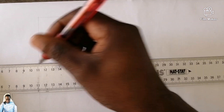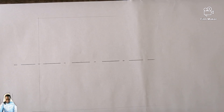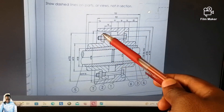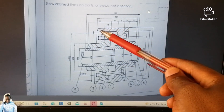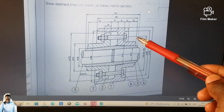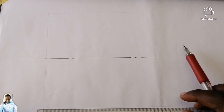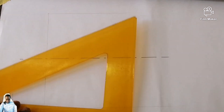From here I can have a center line here, then a faint line like this. Now let's get the dimension from here coming to the side - that dimension is 102 millimeters from here till there. Remember this is not item one, this is item two - it's not part of our drawing. What we are concentrating on is these hatches. The dimension from there till here is 102 millimeters. So from here till there, I can measure that 102 millimeters - there is my 102 millimeters right here.